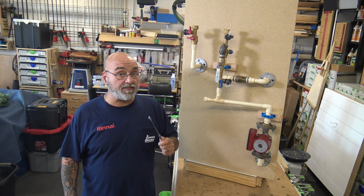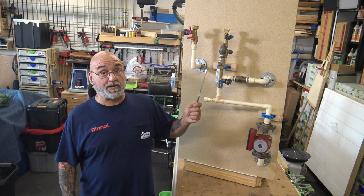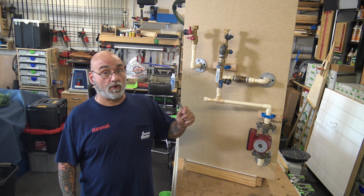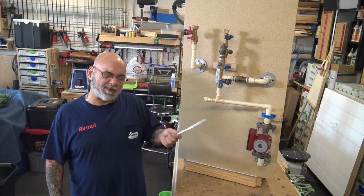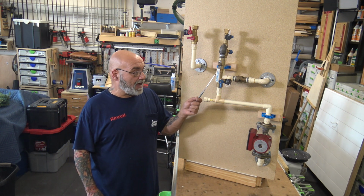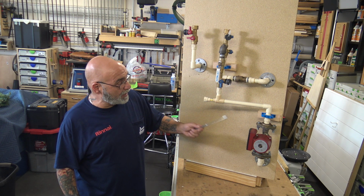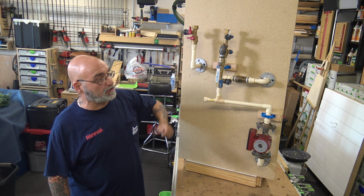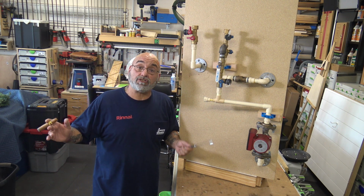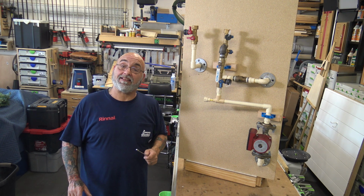Now these were just standard RL units. They were not these RURs, so the older RUR 98s like that. They were not all like this new Sensei. They were all RL, exterior, sometimes interior. Whether the hot and the cold was reversed, the gas was not proper, no proper gas pressure, no regulator too close, no ground, stapled through the controller wire, something. It was always installer error. Never, ever did I have something bad in that unit.